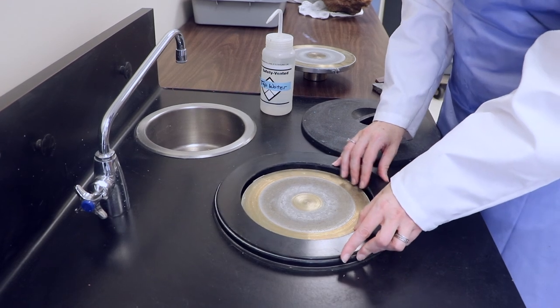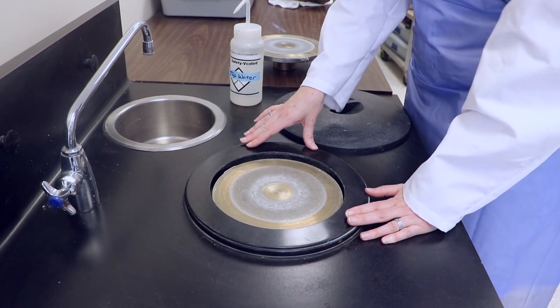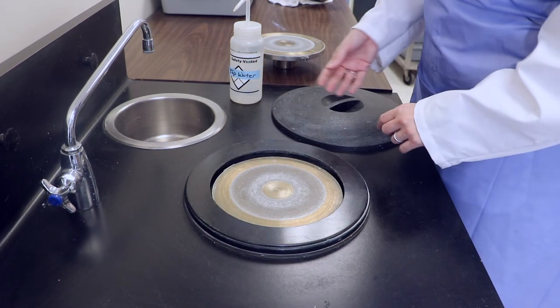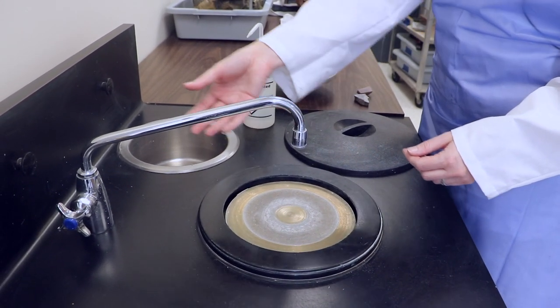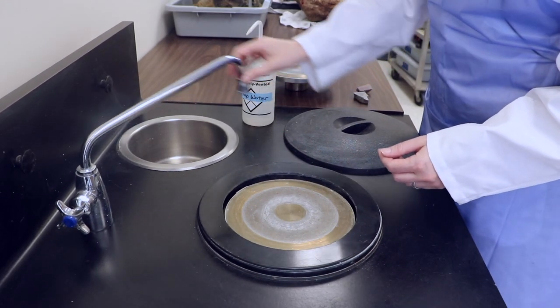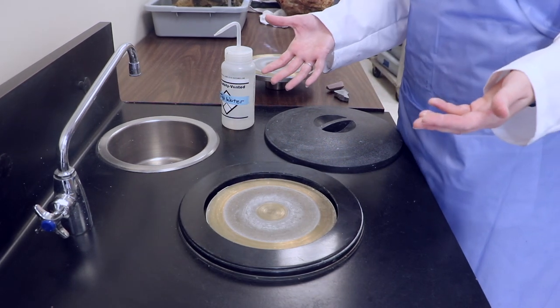Actually, the other thing that you need is some kind of lubricant, and almost always it'll be water, and it keeps your sample from having too much friction against the surface. If you have plumbing, it can work very nicely to just turn on a faucet and have water pouring out on your grinding wheel. Usually there should be some sort of on and off switch.